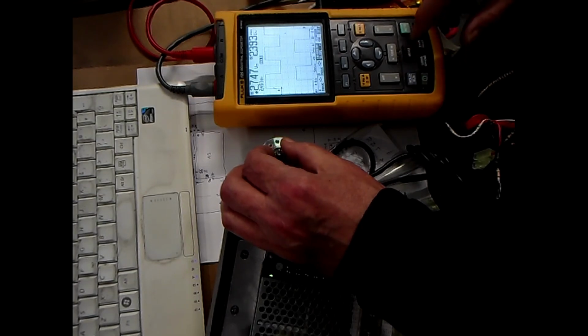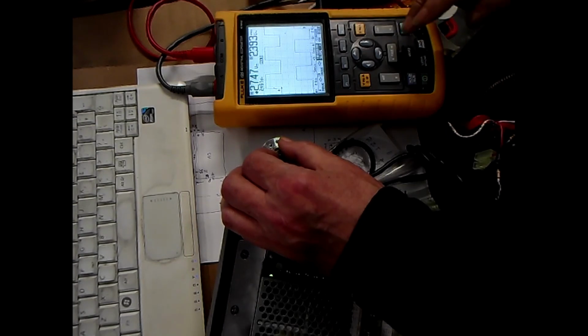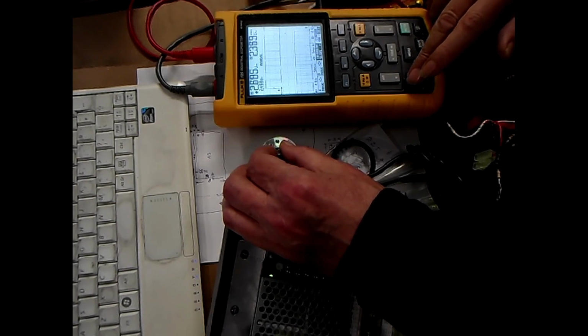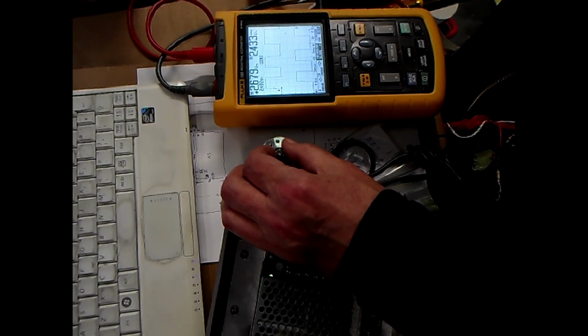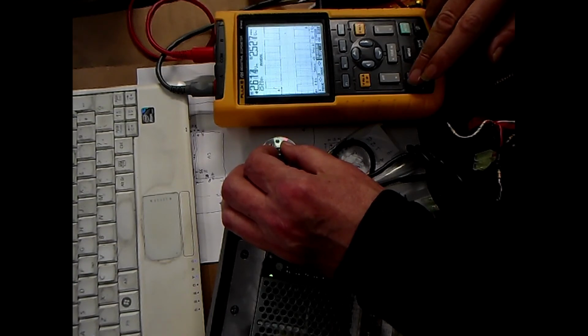A few more lines of G-code. The Z-axis is instructed to move to 20 millimeters above Z0. I normally started at plus 3 millimeters. When Z gets to plus 20 millimeters above Z0, then the spindle is turned on. Power is then restored to the L-box, if it is still alive.